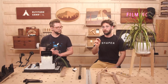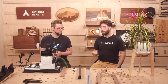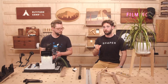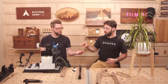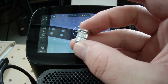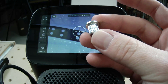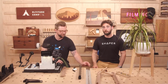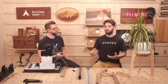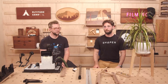These are press-in inserts. The problem that I have with these threaded knife edge inserts sometimes is that they're difficult to get in perfectly straight. And with this joinery, I wanted my threaded insert to be nice and straight, so I found it easier to push that in and add just a little bit of super glue or epoxy to hold it in really firmly than I did to use the threaded insert. Yep. And it's really easy to adapt this project to use any kind of threaded insert you want just by measuring and using offsets.